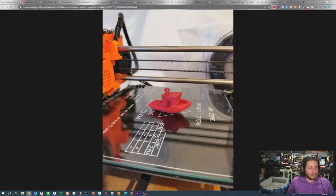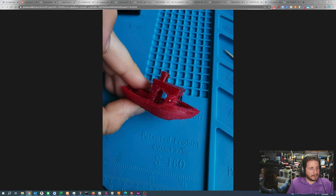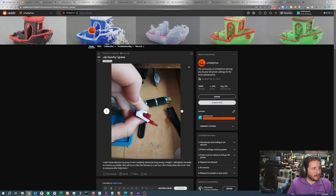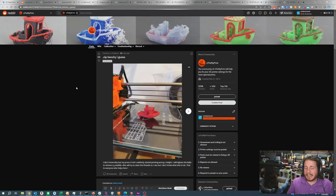You also want to make sure that your steps per millimeter are set correctly. If something went awry in the motherboard and it somehow reset the steps per millimeter — with an older machine it's not unreasonable to assume — you'll want to make sure they're set correctly. Traditionally it's at least 400 in the Z, but you'll have to measure yourself. It's easy with a pair of calipers: send the printer up 100 millimeters and measure how far it actually moved. In this case I'm guessing it moved a lot closer to 50, because this Benchy looks to be about half the height I'm expecting.